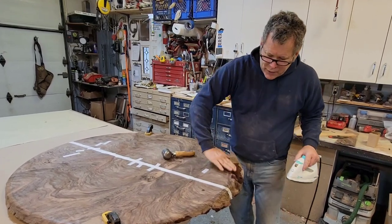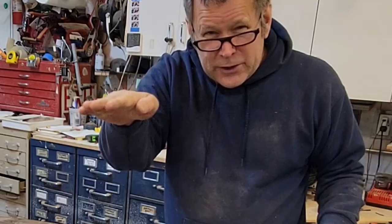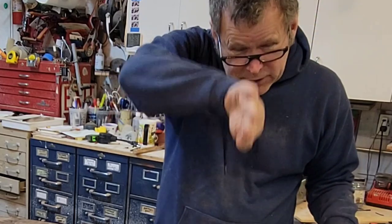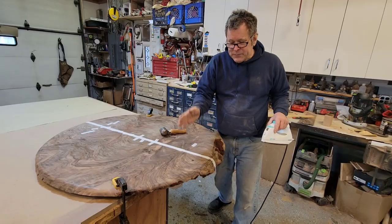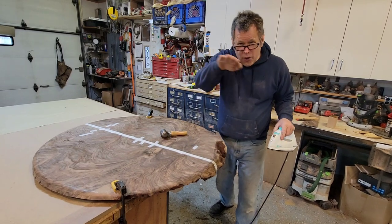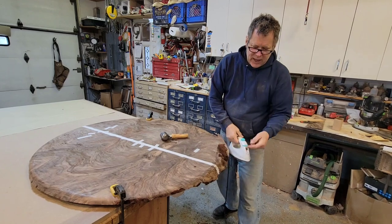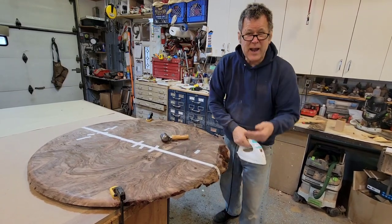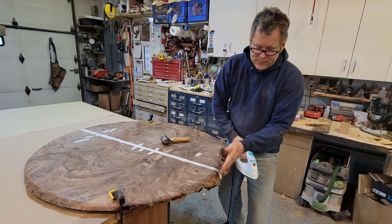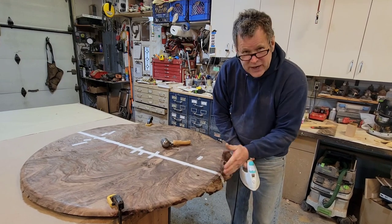In this case, I wet the edge just slightly, and I'm going to do this in two steps. This is sort of a waterfall edge that's kind of a French curve — it starts gradual, then drops off to the vertical plane. So I'm going to massage and first get that long, gentle radius down first. That will start wrinkling up the outside, and the more excess material we have, the more difficult it will be because it's a larger circumference that has to compress down.